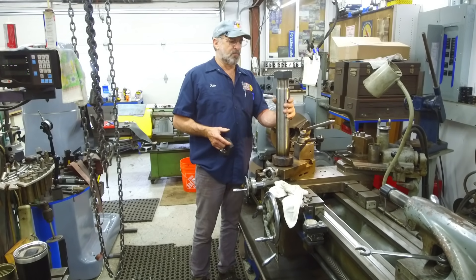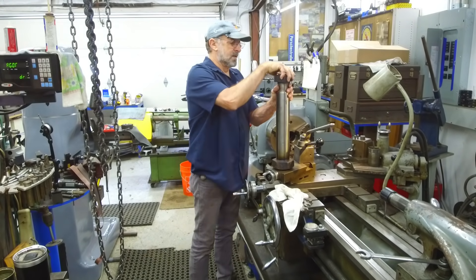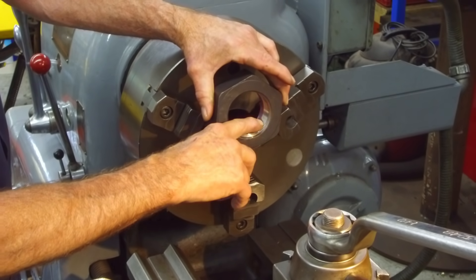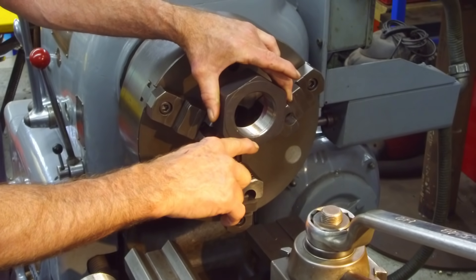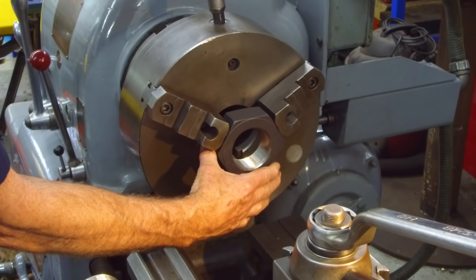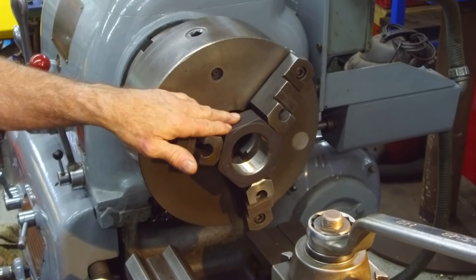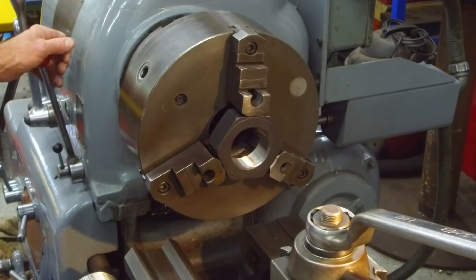If I did have the other bolt, we would 100% make sure both of them are lined up. Let's go ahead and set the nut up in the three-jaw. We need to run and chase these threads. We've got to set this nut up so that we can come in with our threading tool and pick up this thread pitch and give it a skim to open it up so that it fits the bolt properly. We put the nut in the jaws and we're rocking it back and forth, trying to find out where they chucked — there are no chuck marks in here, so we don't know where they chucked on this hex stock to make this nut. But we want to see how we're running.